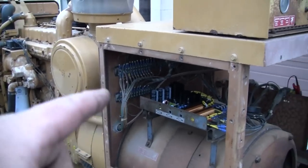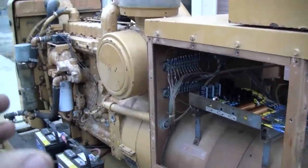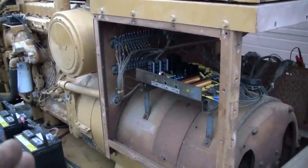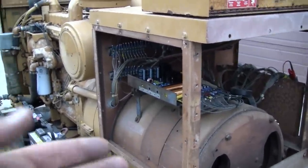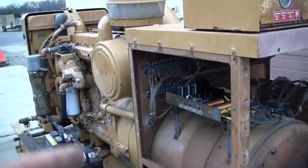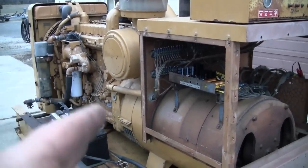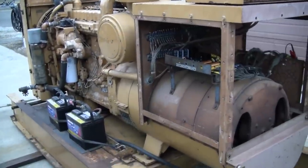What the under frequency roll off does is the regulator senses the frequency that the gen set is running at, which is directly proportional to engine speed. If the engine speed lowers, for whatever reason, the voltage regulator will lower the output voltage a set value, to lower the kW load on the generator end, thus softening the blow to the engine's governor. I have it set currently at 2 volts per hertz of droop. So if our set point is 240 volts at 60.0 hertz, if that frequency drops to 59 hertz, the voltage regulator will lower the line-to-line voltage to 238 volts.